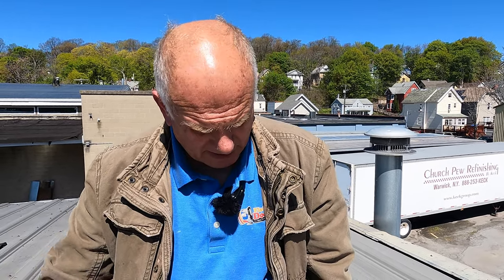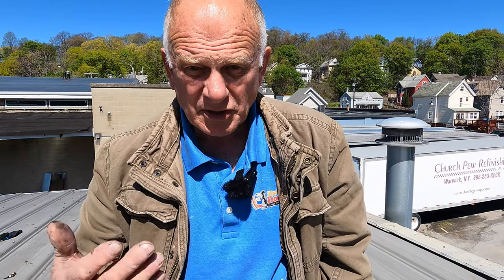Instead of coating your whole roof because you want to stop it from leaking, you're doing the wrong thing. You never coat the entire roof just to stop it from leaking — you fix the leaks. So you find places where people already started to try to fix them, or you find the leaks. I'm going to show you all the places where we find leaks and we're going to fix them.